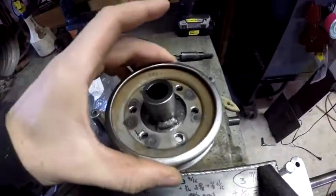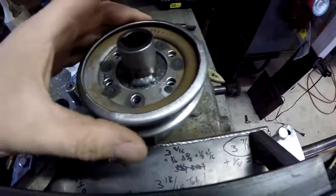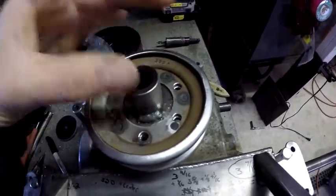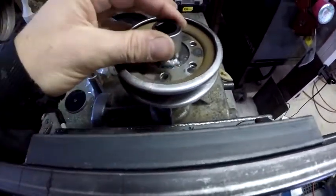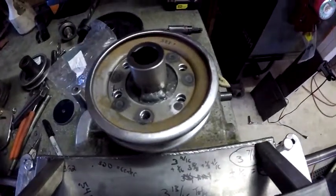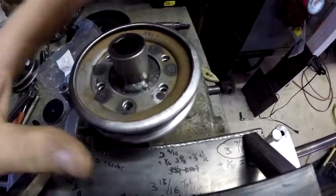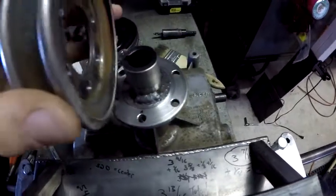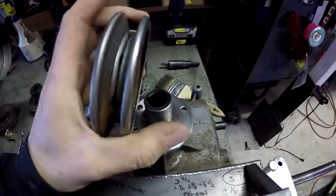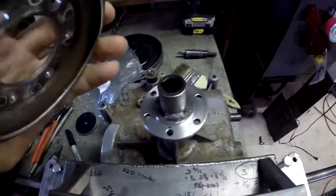The pulley I'm actually going to use sits over — it's got the holes already in there — done. But it's not done. I still need to do a mount up here to support this input shaft, and I need to figure out belt keepers. Now if anybody knows anything about racing ATVs and go-karts, you know where they have the sprocket sitting with a disc on this side and a disc on the other side — like a chain keeper. I'm going to do the same principle but with a V pulley.